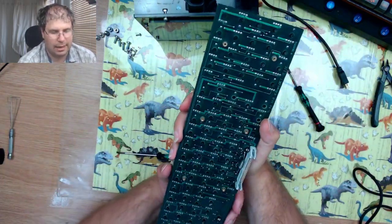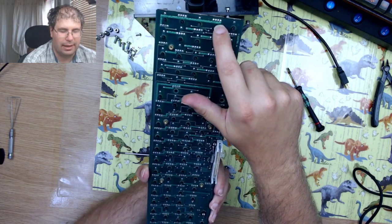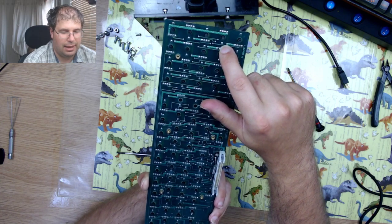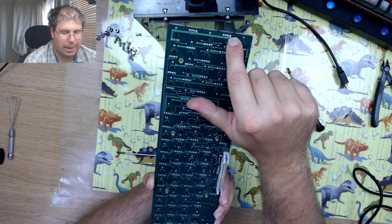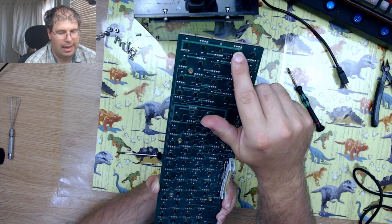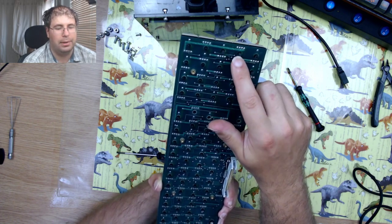So each switch, as you can see, has the four pads that are connected to the Hall effect sensor, plus the single pin opposite, which is just a mechanical attachment point. The pins on either side are 5 volts in and ground. Then the two inner pins, you have an enabler pin and an output pin.